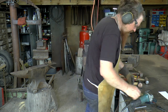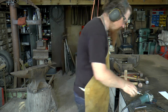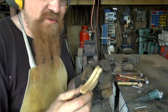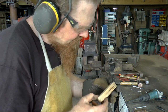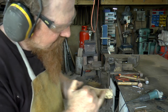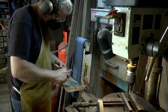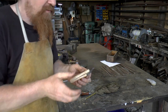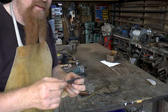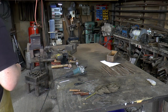Let that cool down slowly and in the meantime do a bit of work on the handle - that epoxy has gone off now. So I can start to work towards the final shape. It's slightly wider on one side than the other so I'm going to sort that out. The next thing to do is to make the mechanism actually work, then I'll heat treat the knife - harden it, temper it - and then it's ready for putting the final edge on and it will be done.